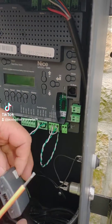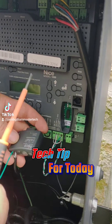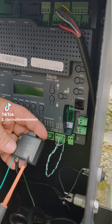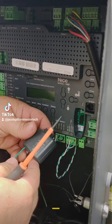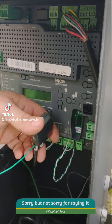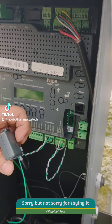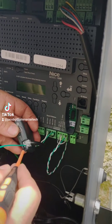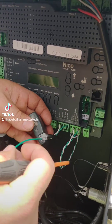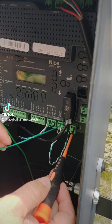Here's a nice tech tip for today on the new plug-in radio receivers they're using on our 1050s, 936s, and 310 boards — this is the OXI BD. They don't have as good a range as the older plug-in style radio receiver. Here's a tip: add a little jumper wire in with the shield connection on this radio receiver. Don't attach it to the old antenna connection shield on the board.